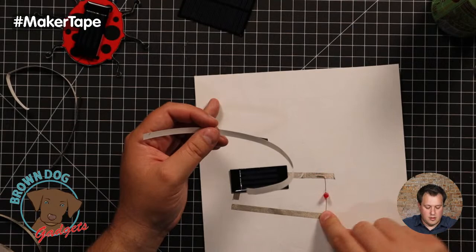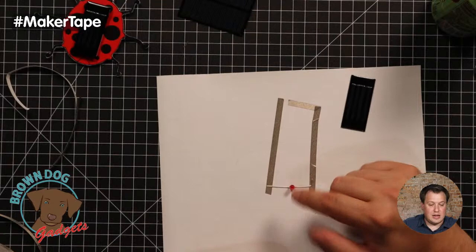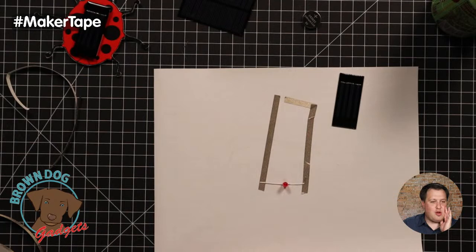Ah, see, that's a good point. Now, in theory, in good practice, you'd want to have a resistor in this setup. This way, you're protecting this LED from higher voltages. But since this LED is like a 2.3 volt LED, and this is a 2 volt solar cell, we're under power. And in most situations, for battery sources like these, power sources, you can get away without using one.